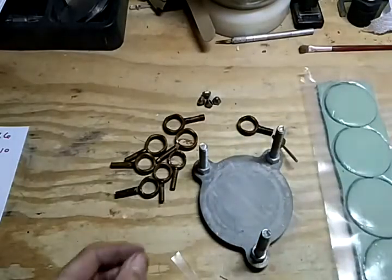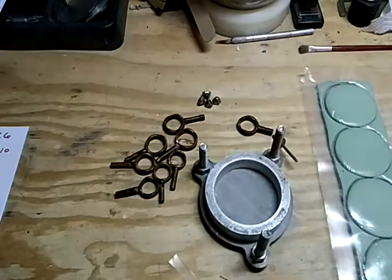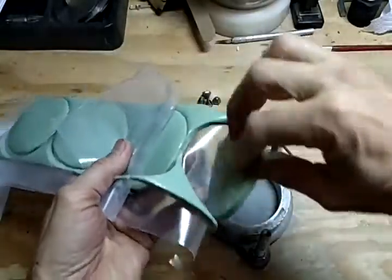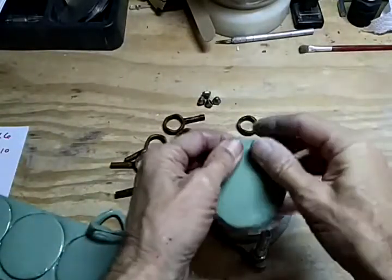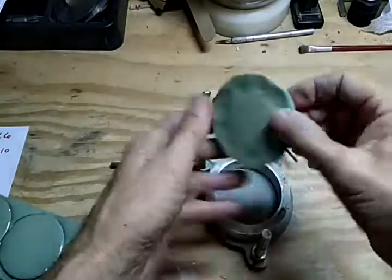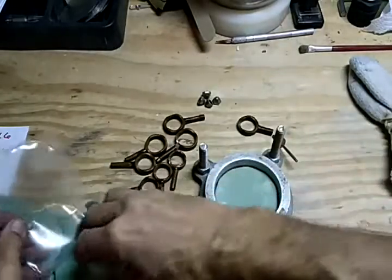powder that, and then we'll powder the inside of the mold frame. We'll set that down. Make sure your hands are clean. We take this, we peel that back. We can peel off a slice, and then we stretch out the edges here, just like that. And then on one side we talc, and we put that side down,